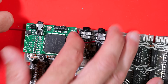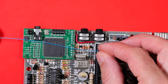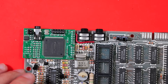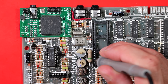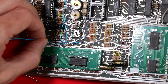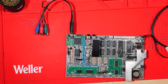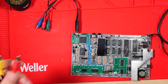I'm using slightly thicker wire for power and found a neat way to run it up and under the board around the side. I'm using thinner patch wire for all the various signal inputs. Thicker wire is a bit more unsightly; thinner is neater but more delicate — you just need to find a sweet spot. After finding all the wires I could leech these signals off, it was all put together. I'll tape the wires down to neaten them and prevent snagging.